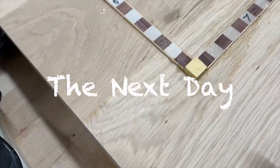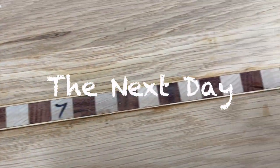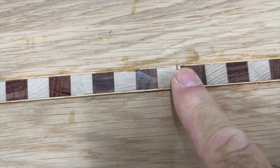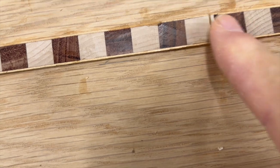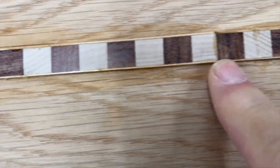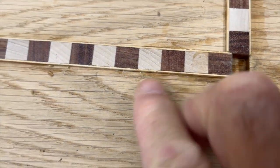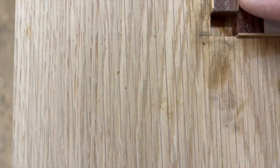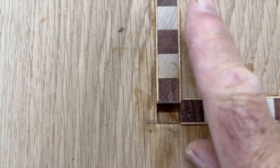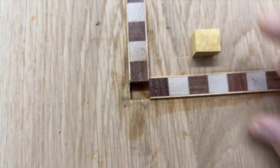Let's see how we did. It's glued in — our little seam is right there, with a tiny gap that the glue is covering. The one issue we have is that this end ended up a little bit too long. I suspect our pieces swelled a little bit when they hit the glue, and we didn't get it compressed enough that way. We'll trim this piece before making the final cut for our final corner.